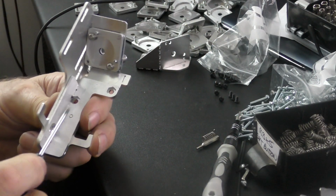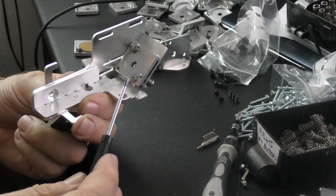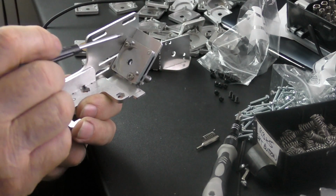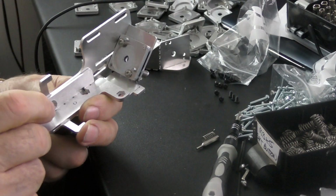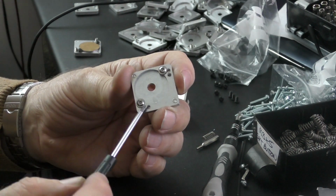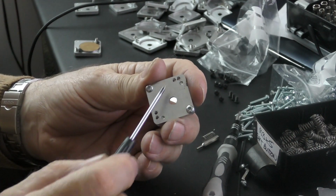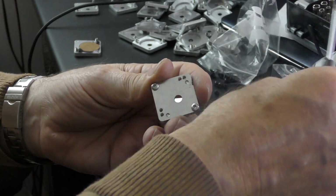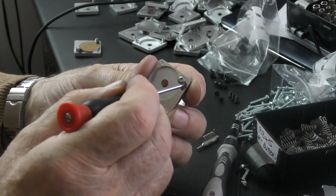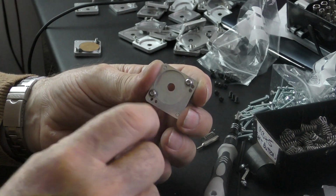When we assembled the mirror holder for the standard Mark II lightweight head, I used stainless steel button head screws, which I said are pretty expensive, but they also take up a little bit more room and overlap the mirror more, which is the original design intention that I had. But when it comes to these mirror holders, we've got a slightly different situation. If you remember, we've got 3 holes in each corner. One of them's for the mirror clamp here, with its flanged button heads, and this one at the back here is for the fixing springs, and this one is a special that I've added that allows you to put an adjusting screw in from the front, because these mirrors are difficult to get to from the back. So I've allowed you to modify and adjust the mirrors from the front.